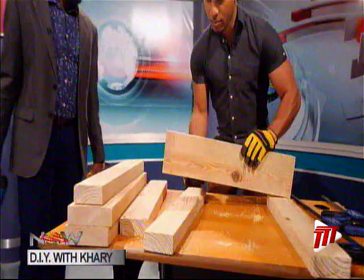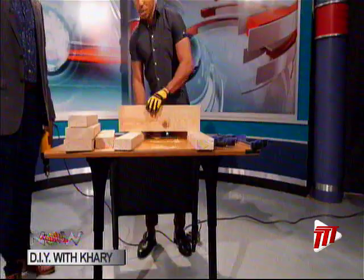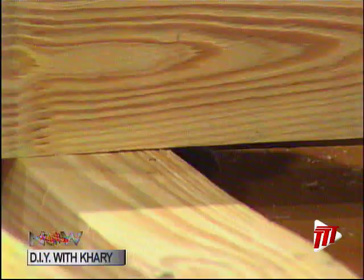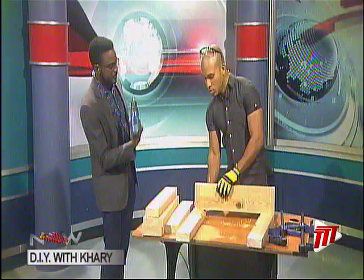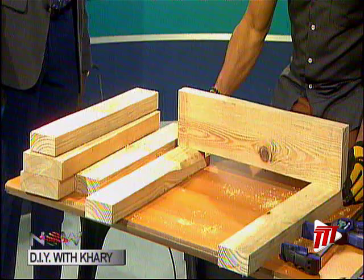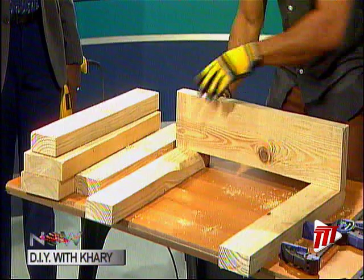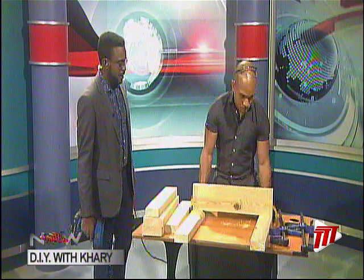So the place where you put the countersink holes - I notice that you flip it upside down. That's right, so the countersink holes are at the bottom. Actually, I put countersink holes at the bottom, the top, and the center. I'm going to clamp these together so I can have everything measured and balanced, so that I can then drill all my pilot holes, followed by the screws, which Rokas will help me with. So you just want to line up all your shelves first and foremost.